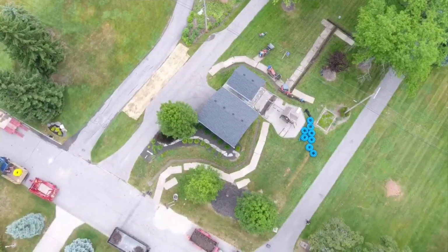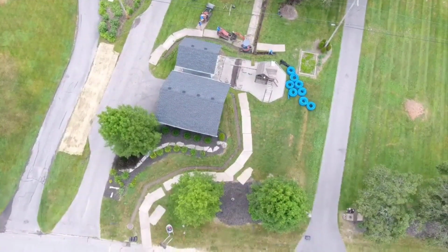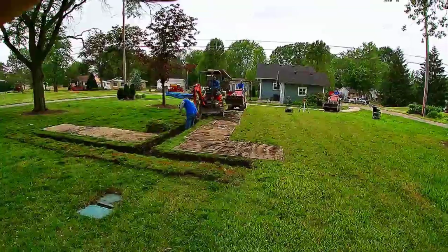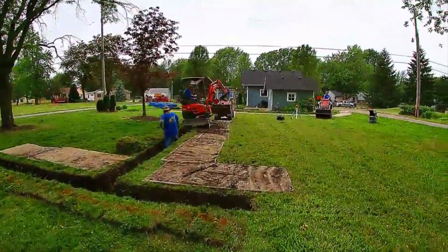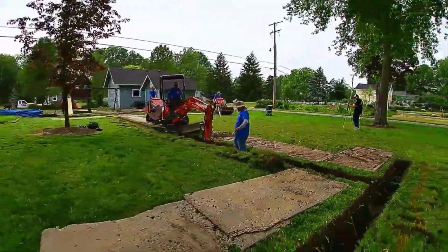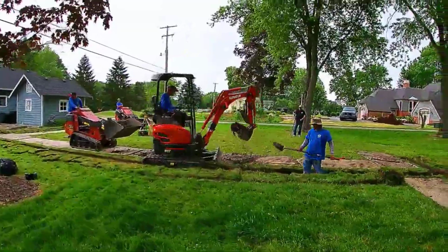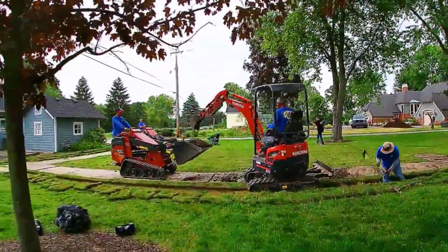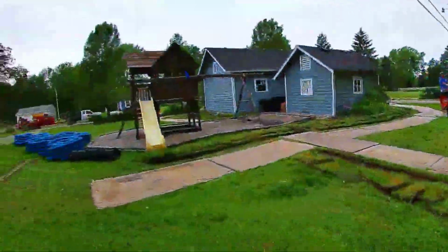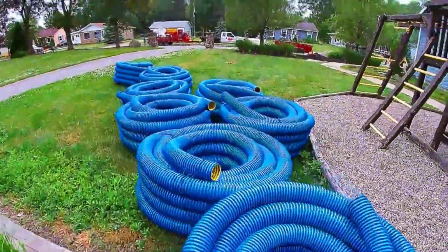So, I ran our drainage system right through the heart of the problem and right through the play area, and it turned out great. It's been in a couple months, 2-3 months now. This, believe it or not, was a spring install. So here we are. It's like a T. So we had a real wet spot, up inside this big, large, flat area. And I told the homeowner, we just got to come up here with a feeder pipe. I got to just tee off and just run it in the troubled area.